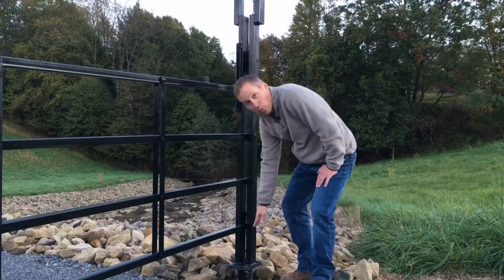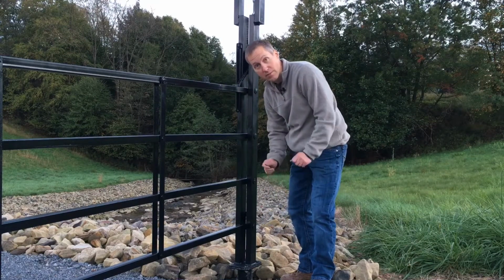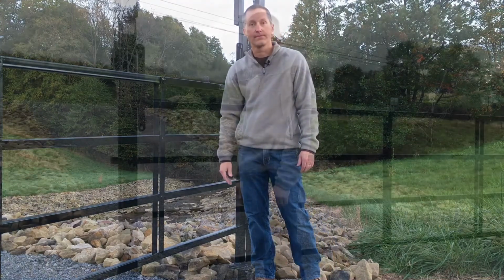The base plate bolts should be tightened 1 week after initial installation to make sure that those are still as tight as can be, and should be checked every 6 months thereafter.